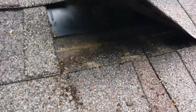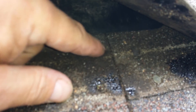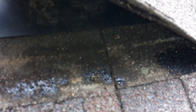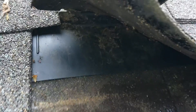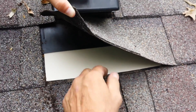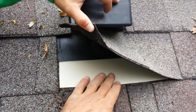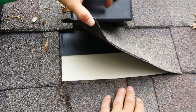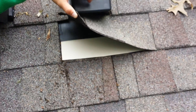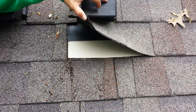Try and get a nice close-up so you can see what I'm talking about. You can even see the debris that's down in here. So what I'm going to do is slip this aluminum up underneath that plastic housing. That's going to keep the water on top of this, and in turn, keep the water on top of these shingles above the splice joint, the splicing area. And everything will be working as designed again.